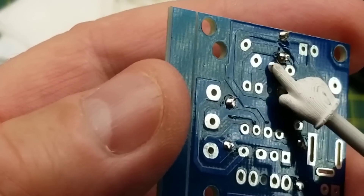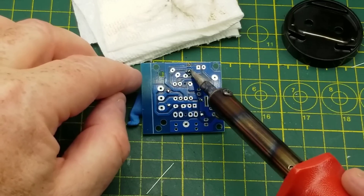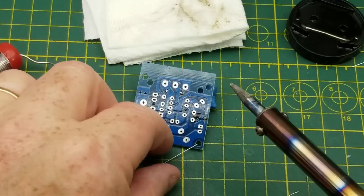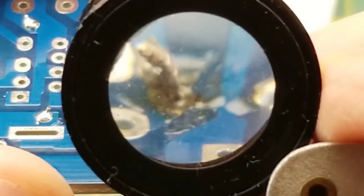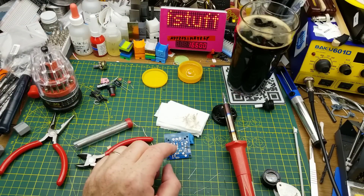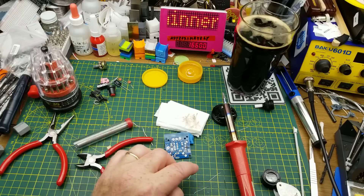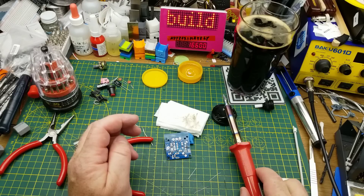That one there is probably the worst, so I want to retouch it quickly. I'll give my tip a little clean and get in there — actually I'll get a little more flux on the tip. Well, that's not improving things — I've actually made it worse. Notice the pad is gone. I threw way too much heat at it with this cheap iron and damaged the pad. As I said earlier, this is probably not the ideal iron — it gets way too hot for this kind of work. That said, it did do five of the six joints beautifully. I just spent too much time in there with too hot an iron.